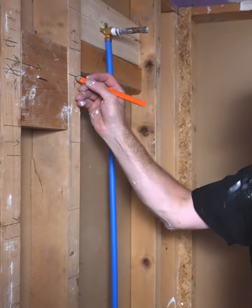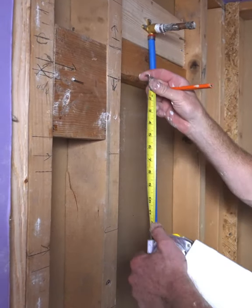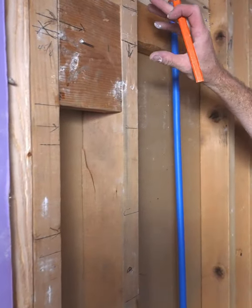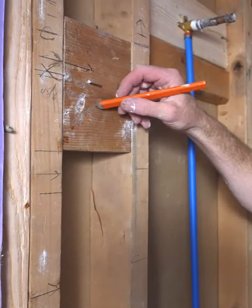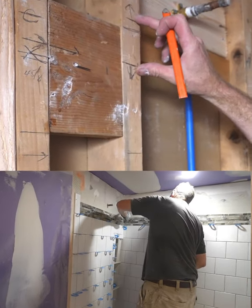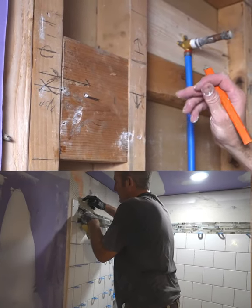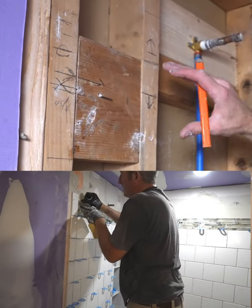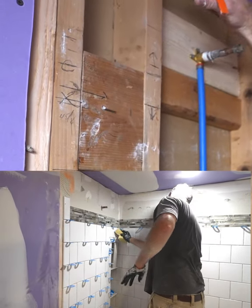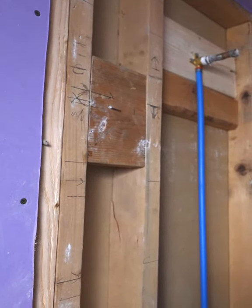This is about where I'd like to have my border, and we're going to be going three to four inches, so we have some variability there. That's going to be nice when you use those mosaics that have a bunch of different components in it — you can rip those down off the 12-inch sheets to be three or four inches wide, so you have some variability there just in case you needed additional height so that you can have your tile finish off. So we'll make this basically where our border is.